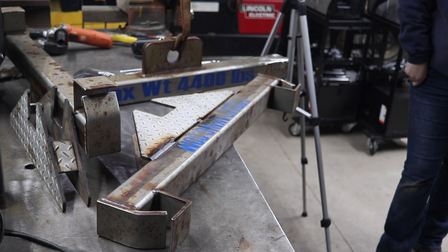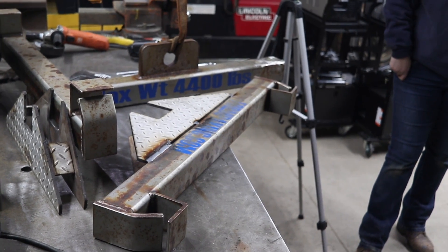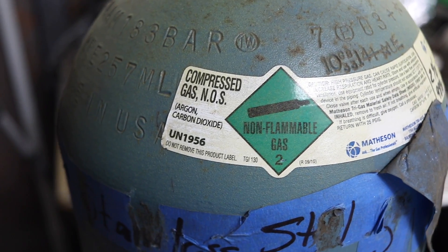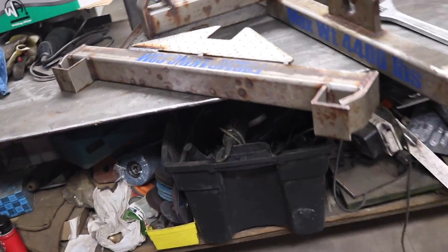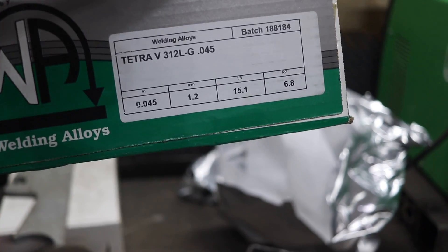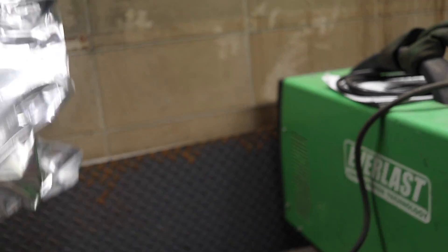After running out of solid stainless wire and doing the pulse MIG stainless, we'll be switching over to a gas-shielded flux core stainless wire. This also requires a gas change — we took off the 98.2 and put on 75/25. We ran out of solid stainless wire, so no more pulse fun. We're giving this Welding Alloy, made in USA, 312 stainless wire a try. This is a test roll so it's a partial roll — I was pretty impressed, it came fully vacuum sealed with some foam in there so it doesn't get damaged during shipping.